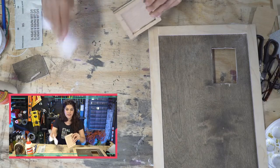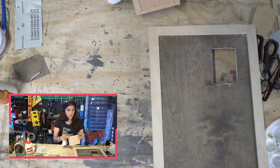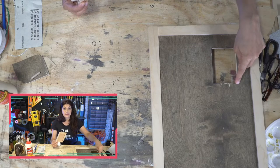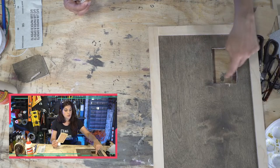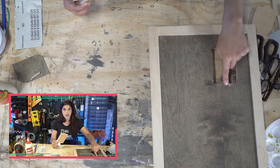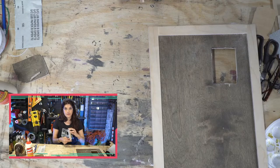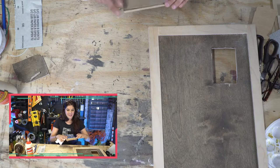And we're going to move on to attempting to paint some straps. And this is where the painter's tape comes in, which I should have busted out earlier and I probably wouldn't have had any of those shards. The other thing I've seen woodworkers do is use an X-Acto knife or a blade and score along the pretty edge, so that when the blade cuts through, the pretty veneer is already cut. So you don't have this nastiness. I was actually going to try that, and I forgot. I got all excited cutting it out, and no.